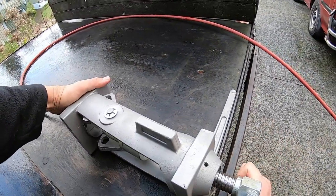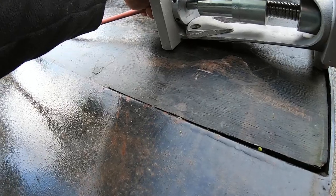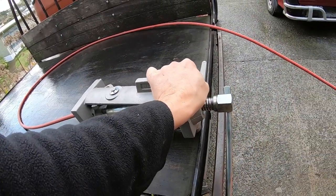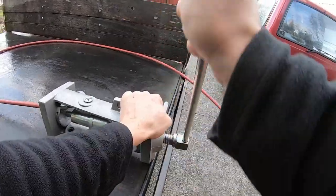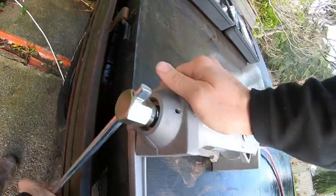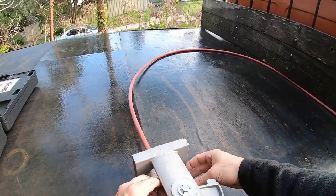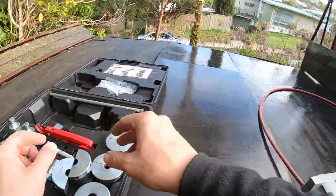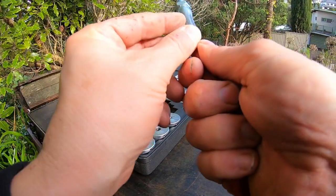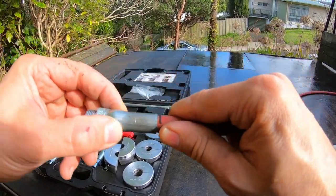I just make sure I keep that until it gets started, and you can see it's pushing itself in. Just finishing this off. And there you can see we're still in line with the mark — it's fully squeezed and pushed home. That's important: if that line had been down here it would have been in the wrong spot. And we've got a nice little bulging on there.